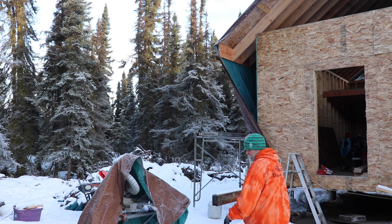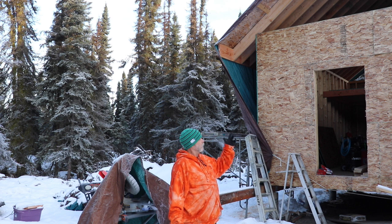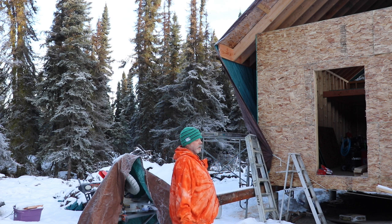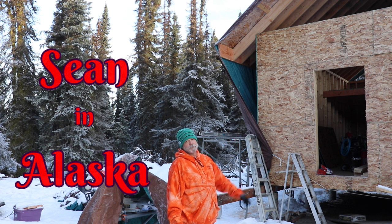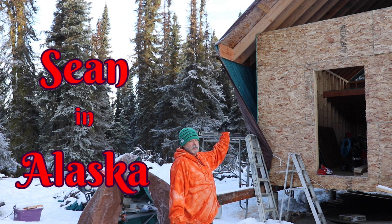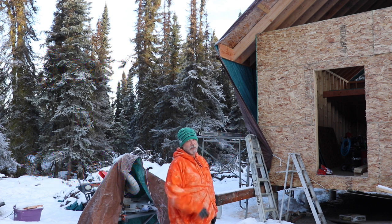Okay, so it's Friday, the week after getting the roof done, and we're gonna work on the gables, but we're not doing that today. Today we're just gonna move the scaffolding from the side of the building over here to the front where we're gonna work on it. The nice thing is I can work on each half of the gable ends at once, so I can get this side done and complete, sheeted for the most part, and move over and then do the same thing on the other side and still stagger everything when we're done.